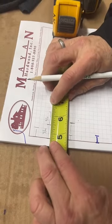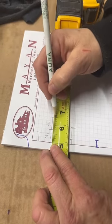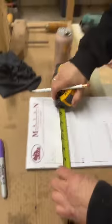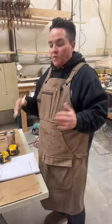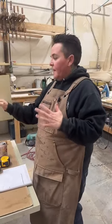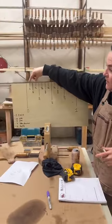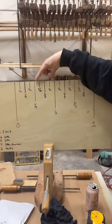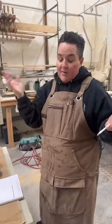And then move my starting point back over here, and these two together is what it is, 1.5 inches. A lot of times it's also easy to think of, if you're not adding 16ths or eighths, and you're just adding quarters, half, 3/4, things like that, you can think of it like a dollar bill. 4/4 in a dollar bill. Here's 1/4, here's 2/4, 3/4, 4/4, okay? So 3 of these is basically 75 cents, which is the way that I think of it in my mind, even though it has absolutely nothing to do with measuring.